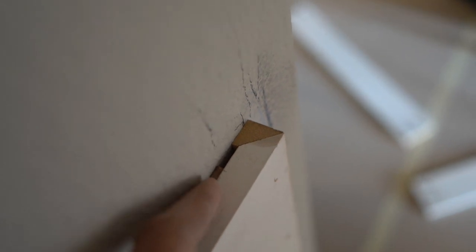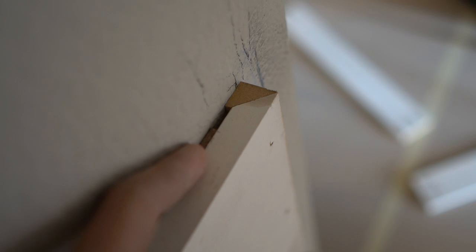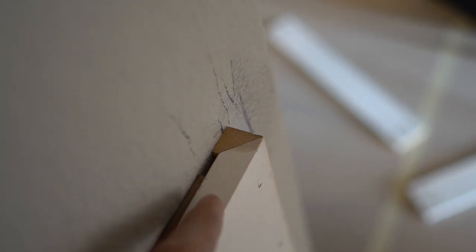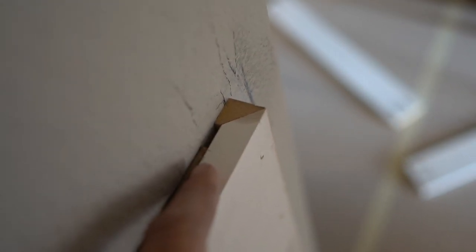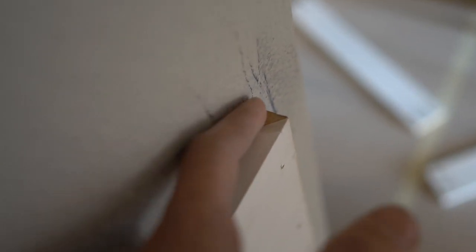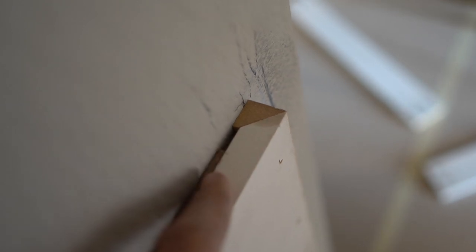So after the installation, this is what you end up with. You can see my paneling back there. It's 3/16 masonite, and it stops short of the miter, so that way you don't have to sit there and fight it if it's not totally plumb, and it doesn't really need to be either way because it's all hidden by the unit itself. And then the miter piece, the return is what we call this, that caps it off, is exactly 3/16, so it matches the paneling.